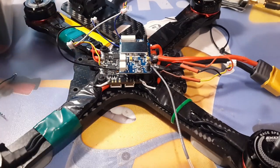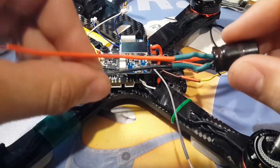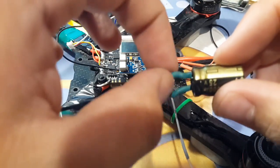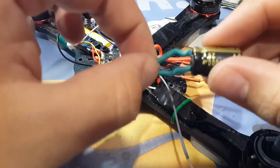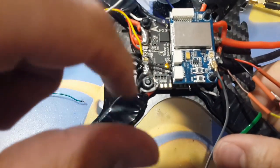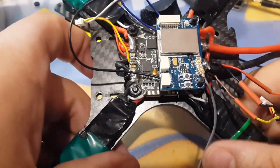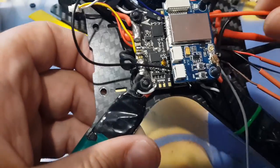I figured it out. What I did is I took some silicone wire — black and red — and soldered it to the pins coming out of the capacitor, then put some heat shrink on it so I won't get any shorts against anything. I looked at the board and saw there's VCC also for these ESCs. The best solution I found is to stick the wires through the bottom of my receiver here.